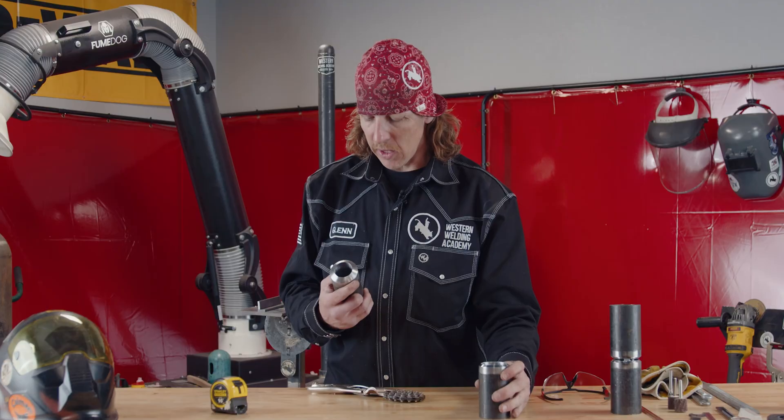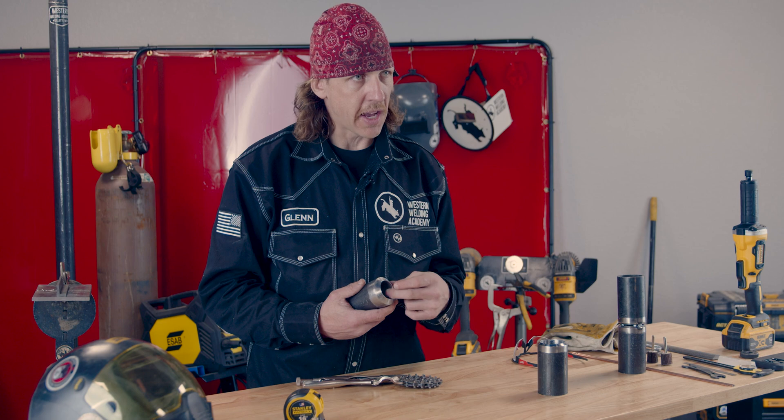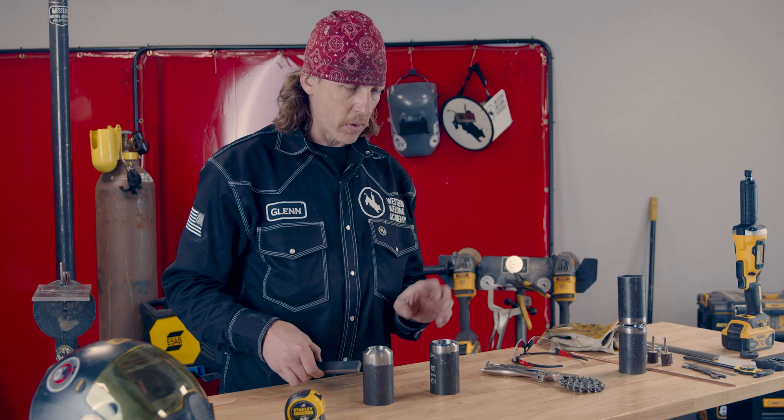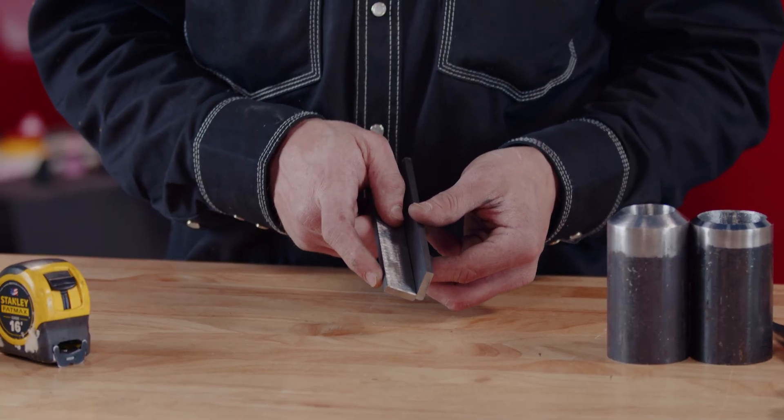The way we're going to accomplish this is we're going to check the inner diameter of this pipe, measure it, then get a burr bit and start honing this out until the two match — periodically checking it through the process to make sure we don't overdo it. Once I get the two to match up, I'm going to tack these two pieces of flat steel together, basically build a jig to hold them so you guys can see the alignment on it.